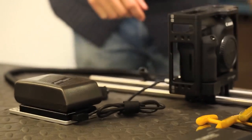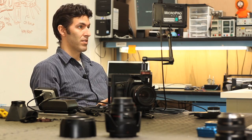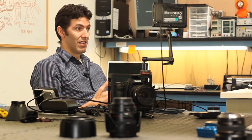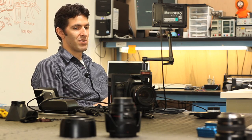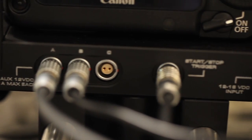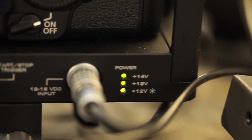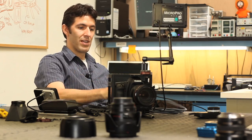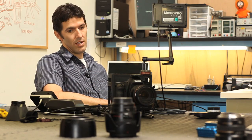The power came in because we noticed that we were spending a lot of time and money on just having all the batteries to run these things. During a typical shoot during the day, you're changing out a battery three or four times. And when those batteries are a hundred bucks a piece, it's much more efficient to have one battery and just run it all day off that one battery. So the cage actually powers up the camera. It also powers up three accessories with 12 volts regulated power. So you can run things like this light panel, your HDSDI converter, a monitor — everything off one battery, which is pretty nice.